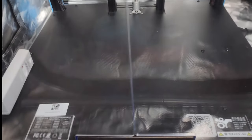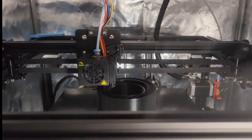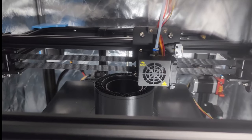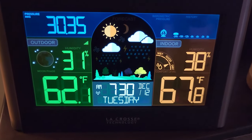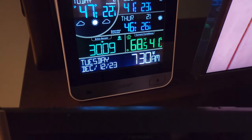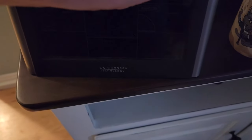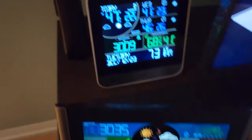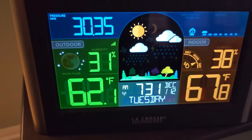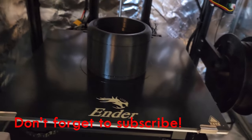At 10 hours and 4 minutes overnight, the print still looks pretty good — no mess-ups, no flaws. By 7:30 the temperature inside the enclosure is 62.1 degrees with 31% humidity, and outside the house it's 27.9 degrees with 87% humidity. It's been pretty cold all night and the enclosure has done a really good job of keeping the temperature right around 62 to 63.5 degrees. Now it's all done and it took about 11 to 11.5 hours.